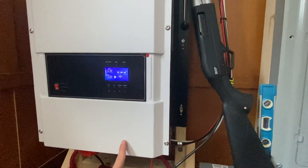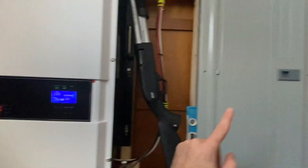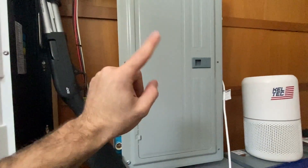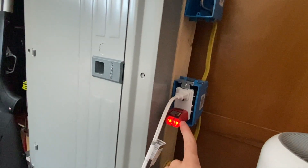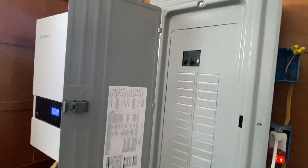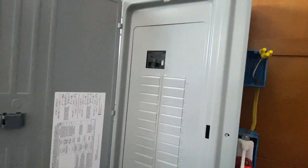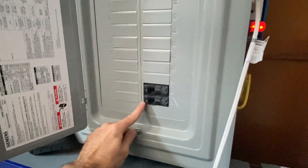When the sun's out, this inverter can convert the DC from the solar directly into AC for my house's breaker box and power the whole house. During the day the sun can power whatever loads you put on it. This is a basic breaker box — I've got a 150 amp breaker, and down here there's a 20 and a 15 amp circuit breaker.